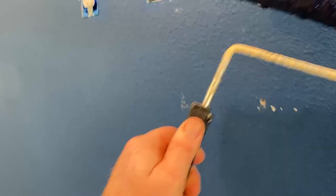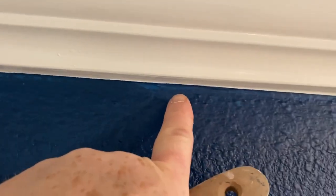In other words, the customer told me, you know, I put a couple of coats of paint, different colors, in these particular areas. So what I'm trying to tell you is that she built up the area in between her texture bumps. And she put it on thick. And so it caused it to flash because there was less texture there, since she added paint to the surface. It's a pretty dangerous thing to do in a main room like this where the light is hitting the wall.